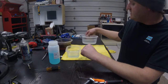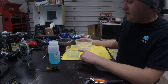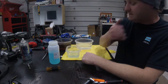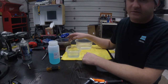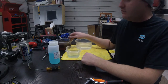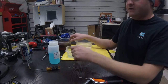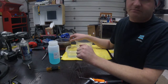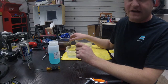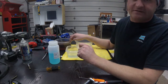The last step after the black oxide concentrate is to give it a quick rinse in basic tap water to remove any concentrate, then do a quick dip in oil. I started out using WD-40 but actually just started using some used motor oil - half empty cans I had laying around. I found that motor oil, even if you dry it out, gives a really nice protective layer to the bolt. It's not greasy at all if you dry it off properly, but it does have a nice absorption into the pores in the metal and should be good protection for quite a while.